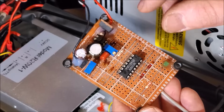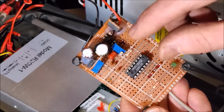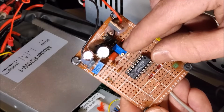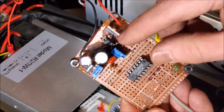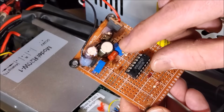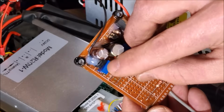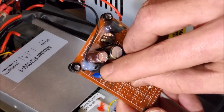Now, I'll link that video below in the description. However, the one modification I made to that circuit is we have the speed adjust potentiometer right here, which sets the duty cycle. But over here, I have in series an optical isolator, a photocoupler. And what happens is when an NTC thermistor changes its resistance value, it'll control the conductivity of this NPN transistor, which is a D822.